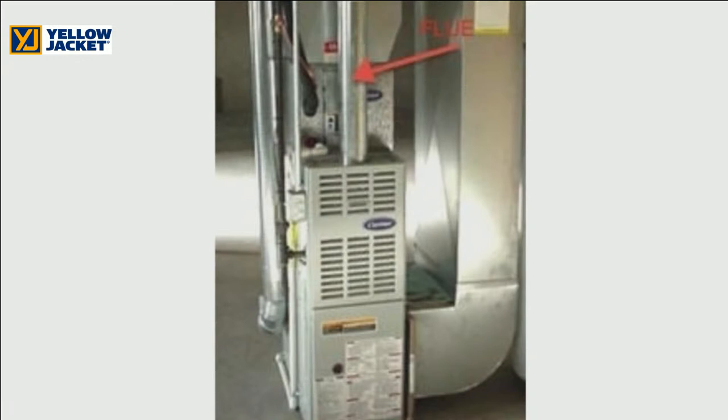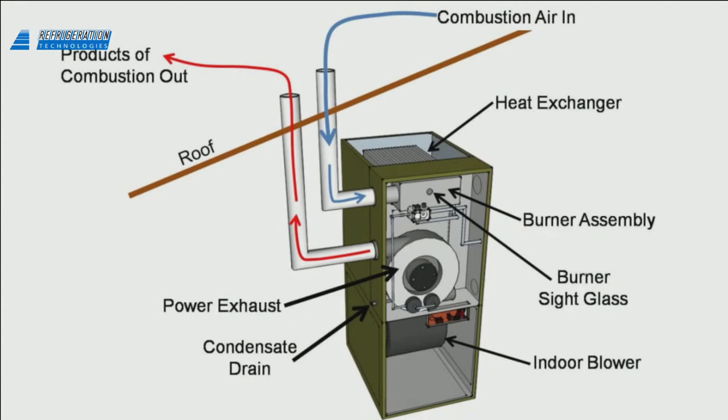So let's take a look at that 90. Let's switch over, and this is a 90% direct vented. Yep. It's a great illustration. But you look at the exhaust pipe, and that's where you want to test. And like you said earlier, a minimum of about a foot off of the inducer at least. And if you're getting goofy readings, there's going to be times where you get flue gas recirculation. Check the intake pipe. A lot of guys look at you like, really?